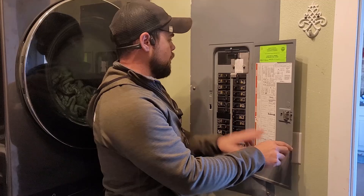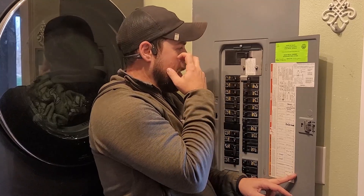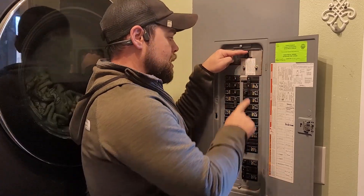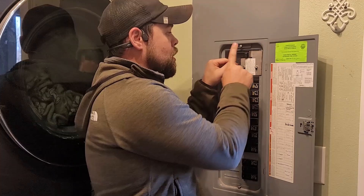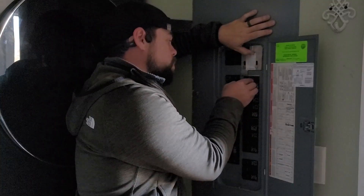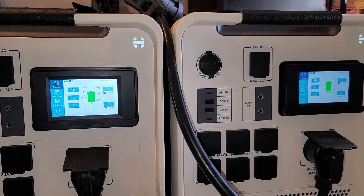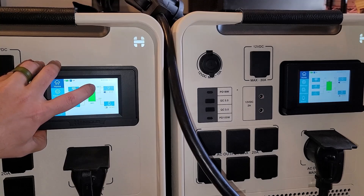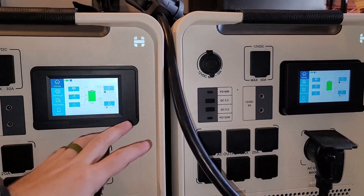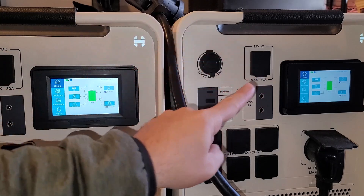This is my main electrical panel. This is my interlock breaker, also called a generator outlet breaker. This is the interlock switch — a physical piece of metal that doesn't allow me to have grid and backup power on at the same time. I'm going to go ahead and turn off grid power — see the lights went out. Now I can lift up this piece of metal and turn on this breaker. We now have power to the whole house running on the Apollos. I have a 468 watt load on this leg and a 99 watt load on this leg.